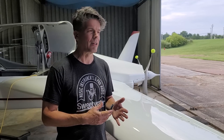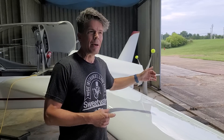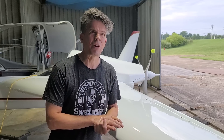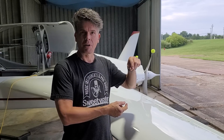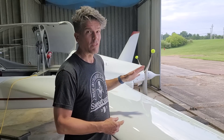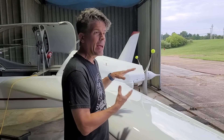The next thing I thought — the new propeller. Maybe it isn't moving enough air, maybe it's putting more load on the engine. So to test that, I put a manometer on either side of the cylinder, which measures air pressure. That way I can get the differential air pressure going across the cylinder and see if it's sufficient. The initial test showed it was not, but I realized one of my tubes was pinched. I went up again and found I was seeing six to seven inches of water differential, where Lycoming says you need five. So I've got more than enough pressure differential — the cylinders should be getting cooled.